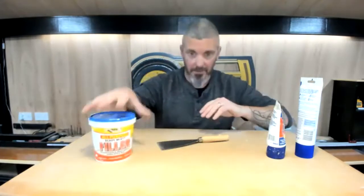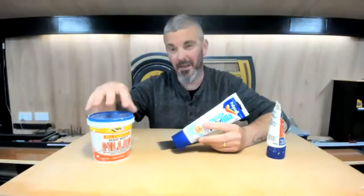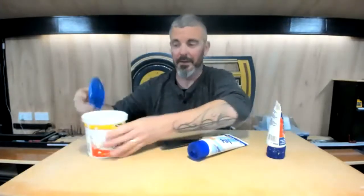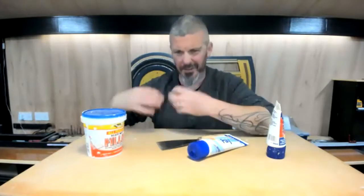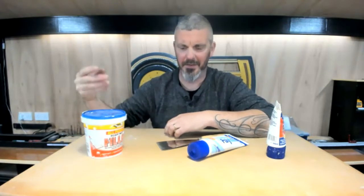Now, I always have a tub of it, okay? But I really got to say, I really like this guy as well. Again, inside in the hardware store, a couple of quid. This stays forever and a day. These are a nightmare to keep wet. Anytime I finish using my filler, I'll always go to the tap and throw in a few little bits of water and then seal it up again, just to try to keep the water in it, because it is a devil for drying out. So really try and keep them clipped properly and keep it as moist as you can.